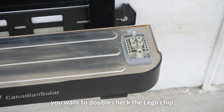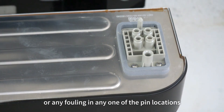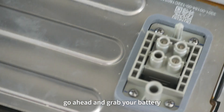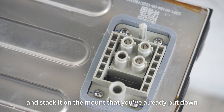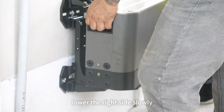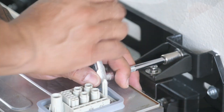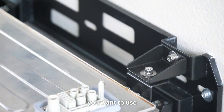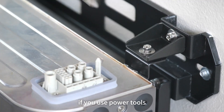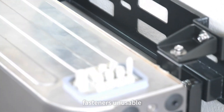When you're ready to stack your batteries, double check the Lego chip to make sure there are no particles or any fouling in any one of the pin locations. Once you're sure the Lego chip is clear of any debris, go ahead and grab your battery and stack it on the mount you've already put down. As you stack your batteries, align the left side first, then lower the right side slowly as it inserts into the electrical connection. Go ahead and secure the side bracket plates. As you're mounting the bracket assemblies, use hand tools to avoid galling with the stainless steel fasteners. If you use power tools, be extremely careful and run them at their slowest speed to avoid galling and making the fasteners unusable.